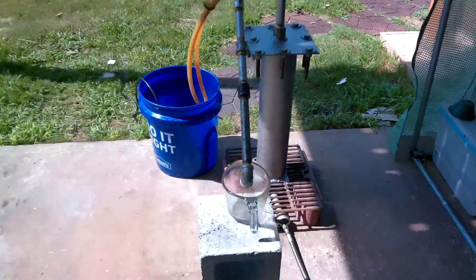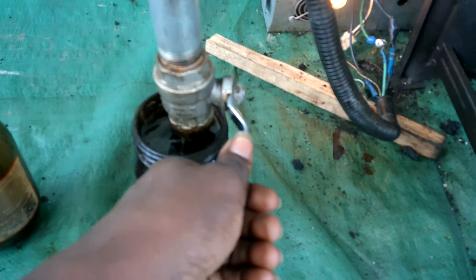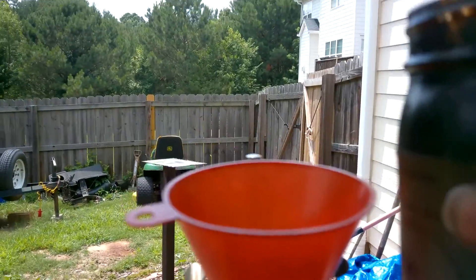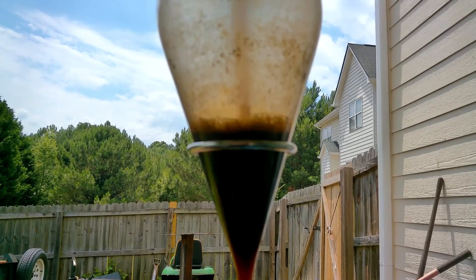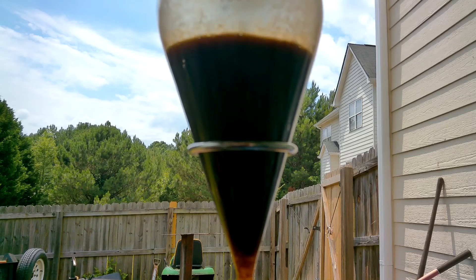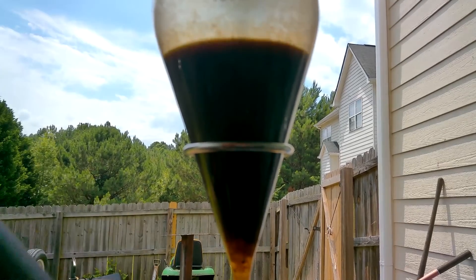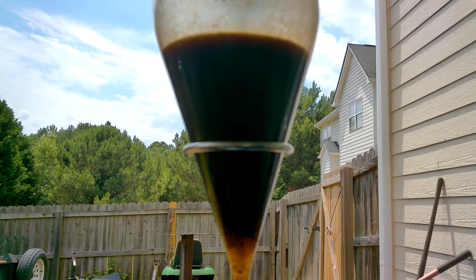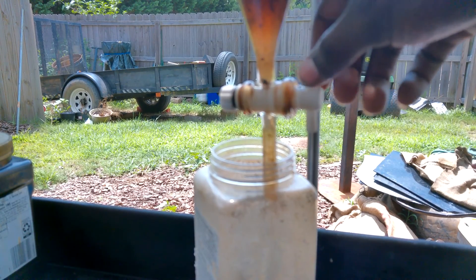So I had to get some pure pyrolysis oil first - it took about a day to get this much. I get it right from the reactor and put it in the separatory funnel, because at least half of all pyrolysis oil is water. That's because there's some oxygen and hydrogen in plastics and in the reactor - they're going to combine and make water. You can see it's starting to separate, and it was about half and half, maybe a little bit more of one than the other.